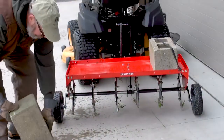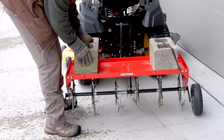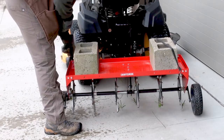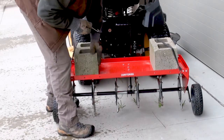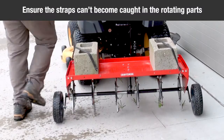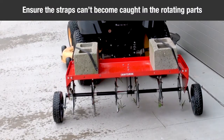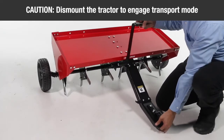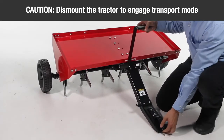To increase the depth of plugger point penetration, up to 140 pounds of weight — such as bags of sand or four concrete blocks — may be added to the tray. The weight can be secured to the tray with ties or straps fastened to the front and rear of the tray. Take care when fastening so that the ties or straps cannot be entangled in the rotating parts. Caution: to prevent injury, dismount from the tractor to raise or lower the aerator when it contains added weight.